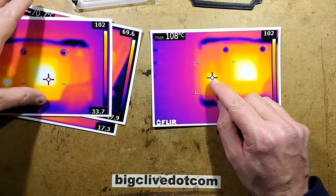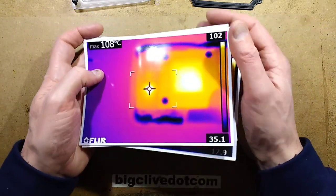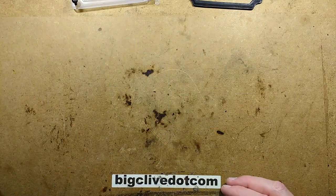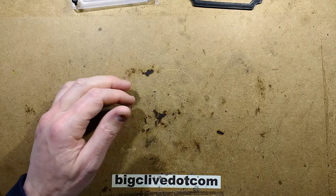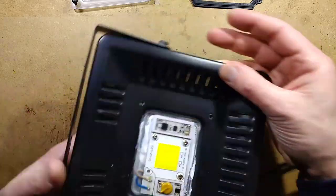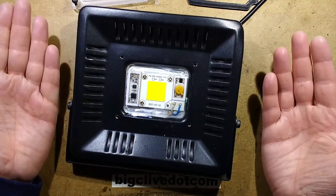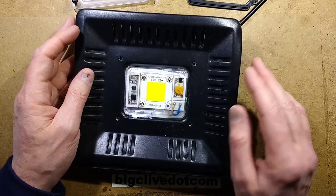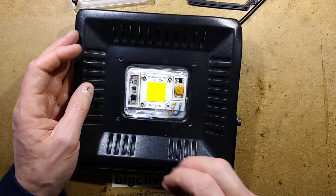The sense resistors might have been warm, but if the sense voltage is very low that wouldn't be such an issue. The question is what voltage is being used to drive this — if it's a MOSFET it usually requires about 5 to 12 volts to drive the gate. Without knowing what that chip is, and having tried various searches for similar chips by component arrangement without finding it — many of these are such specialist chips for the lighting industry that data is never made available. It may also be very new, since the light has a 2017 date.